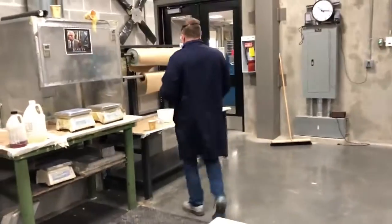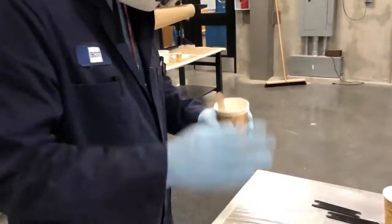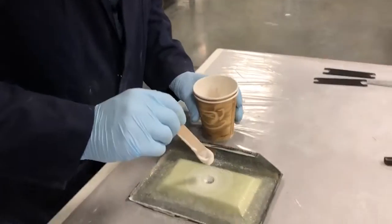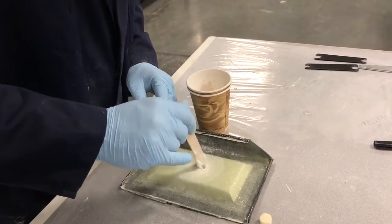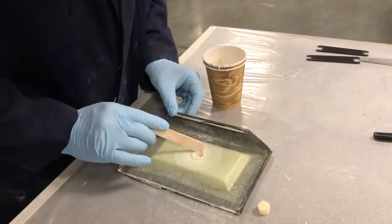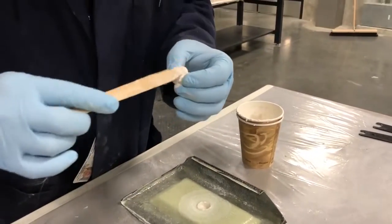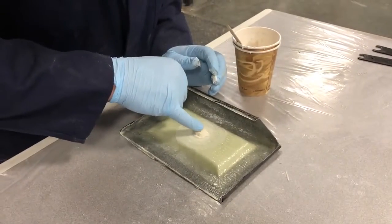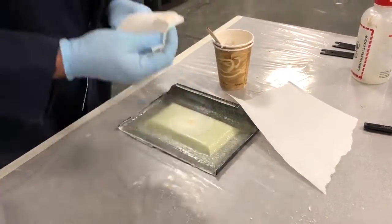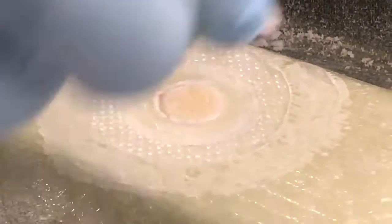Add those micro balloons — we want the consistency of runny toothpaste. See, it's nice and thick but not so thick that it can't be moved around. Fill that hole completely full of material, making sure the sides get fully connected. I got a little too much in there, so I'll scoop some out — want about a third of that hole filled with the mixture. Next, butter up the edges of the plug and the bottom so that when we put it in, everything is absolutely assured to connect, giving us a good solid bond. Work it down nice and slow — the excess material should come out the sides, which is perfect. Wipe the excess with a cloth and you should see the central core with just a white ring around it. That's just about perfect — fully seated, nice complete connection all the way around.